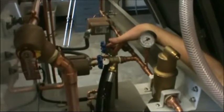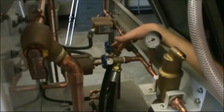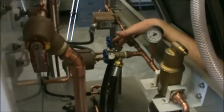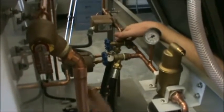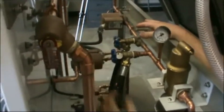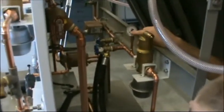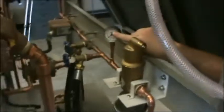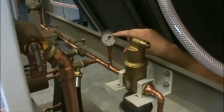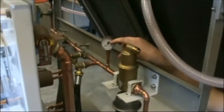In a previous video I turned the pump on and we saw how quickly that fluid flowed through. I'm not necessarily interested in massive amounts of flow — I'm looking for small amounts of flow. So what I'm going to do is open my drain first, not all the way but quite a bit of the way. The reason for that is I'm going to have to maintain pressure here. Right now we're at about zero. I'm going to purge the system and I do not want to exceed 15 PSI on this particular trainer.